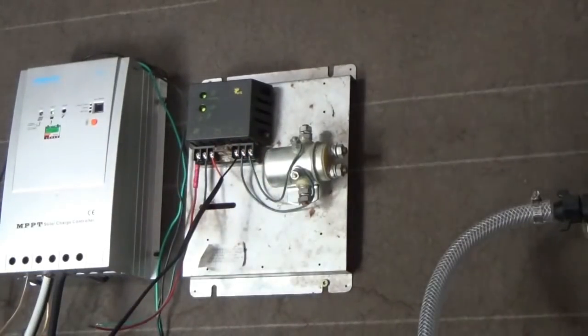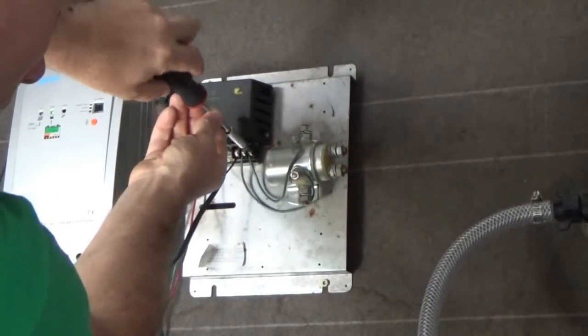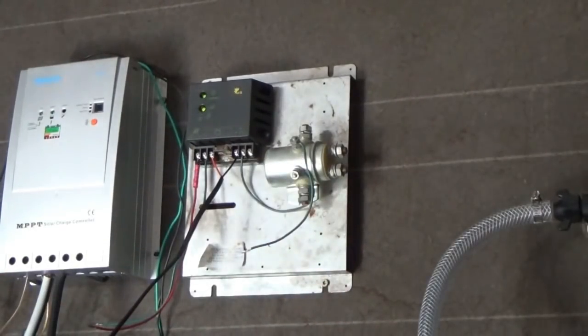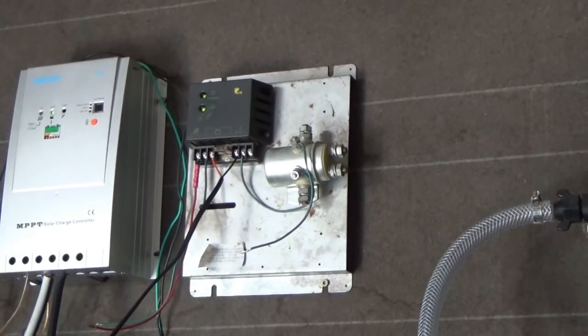Because what it is doing now, I have to go in and see if I can find the rheostat settings in there. What it is doing right now is kicking on the output. The batteries are at 14.5 volts in absorption mode because the MPPT solar charge controllers are putting the batteries into absorption mode right now. And this charge controller here is a cheapo, but its settings are set to a lower voltage.